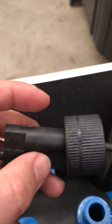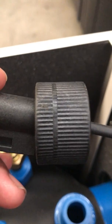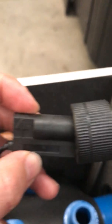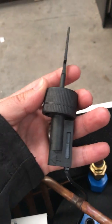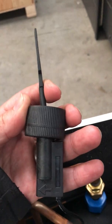What I want you to try to do while you've got that switch out, if you can grab your heat pump ready plumbing, make sure the two valves off to the heat pump are closed, but open up that middle one, which will allow your circ pump to flow through the normal circulation channel. And if you could just have this flow switch out and actually push the paddle in the direction of the arrow. So it may require you and somebody else to give you a hand, but if you can just do that. So this way we're trying to eliminate the switch as part of the problem.